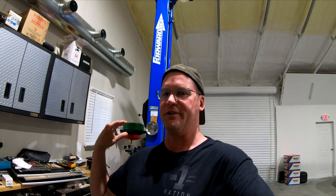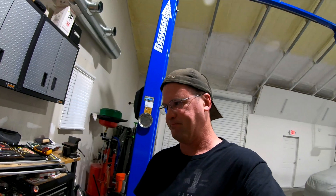Today I'm going to talk about the HVAC system for the house. I've got the fan motor — it started making noise, which is an indication of the bearings going bad. It's making a squealing or whining noise, pretty loud. I could hear it actually in the house when it started running. Normally you don't hear the fan in the house — you can hear it outside, but not inside.